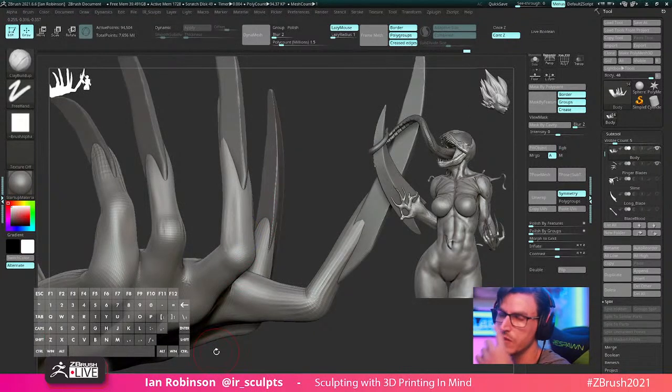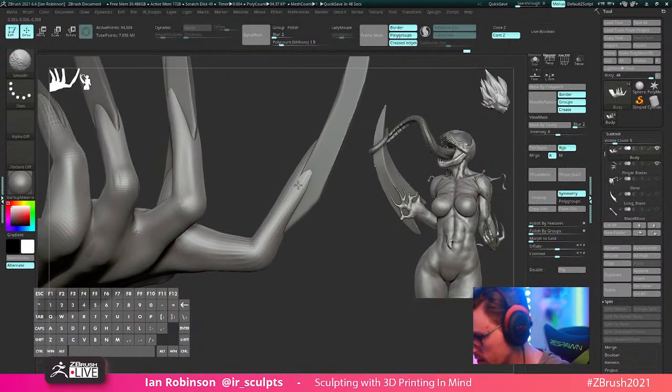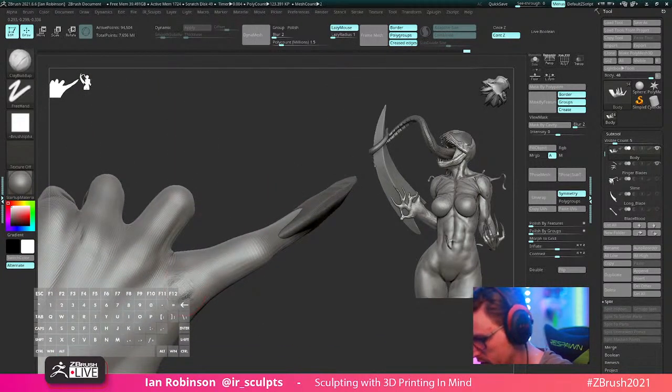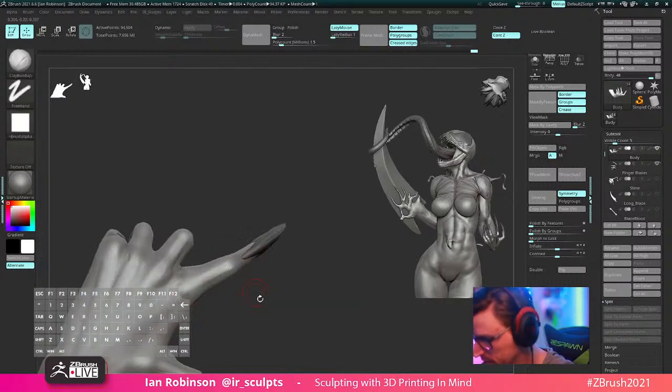Actually, I recommend doing that if you use a lot of wood material too, because of just how porous it is, and with wood filaments, things can gunk up really, really simply. A hardened nozzle is easy to clean, easy to manipulate, and you're not going to mess up the tolerance of that nozzle as easily as you would a bronze or brass nozzle. I think they're brass.